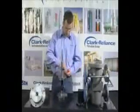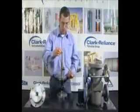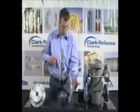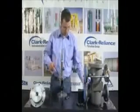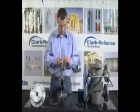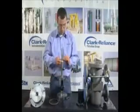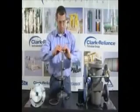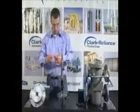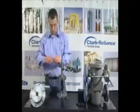The next step is to finish replacing the seals. Slide the seal retainer on top of the sleeve assembly, followed by a greased lip seal with the O-ring side facing down to contact the seal retainer. Also, grease the large lip seal and place it on the separator plate with the O-ring side up.